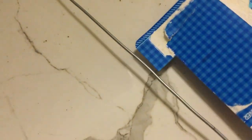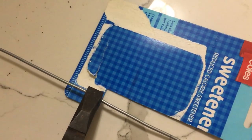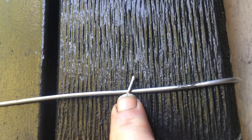The length of my fence is 2.80 meters that I'm going to be installing. I've cut out a small template from this 2.50 millimeter galvanized tie wire which has got a 10 centimeter gap, and what I'm doing is placing the end piece over the bent wire like that, then taking my pliers, lining it up with the other side, and bending the wires to make a zigzag pattern. Because my little fencing is going to be sloping at quite a steep angle and the wire will probably slide down, I've taken some panel pins and just knocked them in and bent them up to secure the wires so that they don't slide down my column.